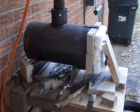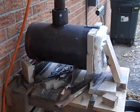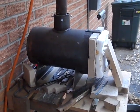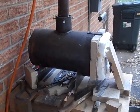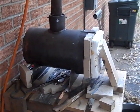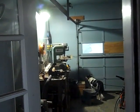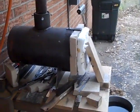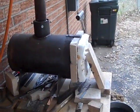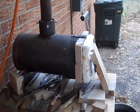That's going to make the process of grinding and filing the final profile much easier than if I tried to work with a hardened piece of metal. So we're going to anneal it overnight, then tomorrow come back, do some work on the grinding and sanding machines, get more of a profile, and at that point then we go through a different heat treating process to harden and temper the blade. Right now we're annealing the blades.